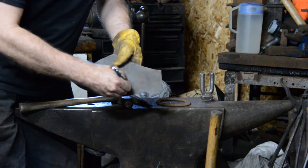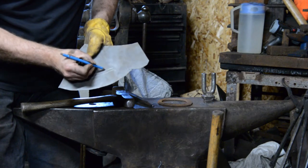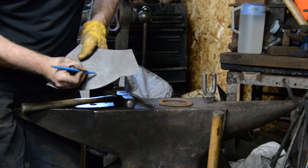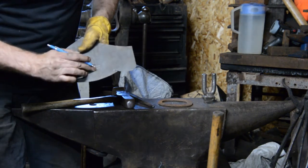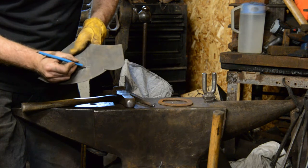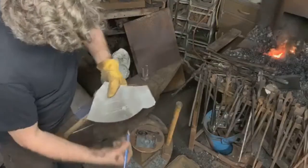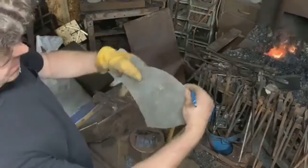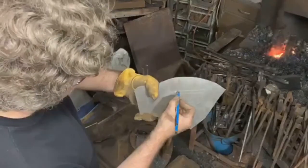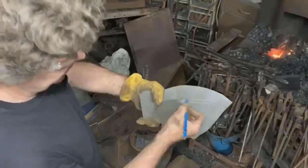If this is my piece — this is my horseshoe here, and this is kind of the wall — what I'm going to want to do is have a kind of a loop like this going through. This is then going to go through here, and I'm going to create my blind rivet. What I want to do is make the hole in it like this, run my material through, and then hammer down. When I hammer down on this rivet, it's going to fill this opening. But I don't want to overfill it. Normally when I rivet, I would want a big head on it — in which case I don't need this to be on an angle, I could just go straight through, and then this extra material would form a rivet.